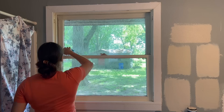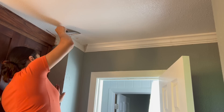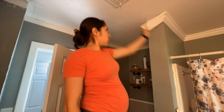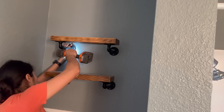If you want to create less dust, you could take a damp cloth and remove excess wood filler instead of sanding — just be careful not to remove too much. When I removed the crown molding, it left behind quite a bit of caulking as well as chipped and peeling paint, so I scraped it all off. Always remember to score with a knife before removing trim or molding to avoid as much wall damage as possible. I also had to remove the shelves above the toilet in order to paint and caulk the edges of the vanity for a seamless transition between the wood and the wall.